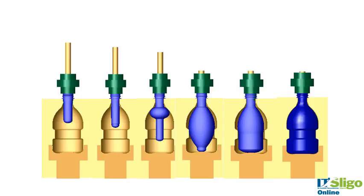Another example here. This is a fixed mold. The polymer is extruded, and the compressed air pushes the plastic to the edges of the mold, and you get something like this — a bottle shape.